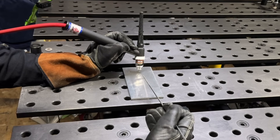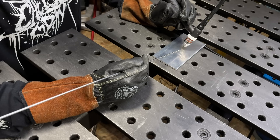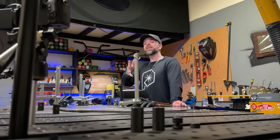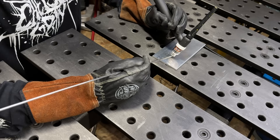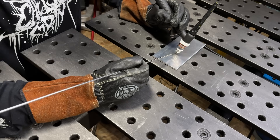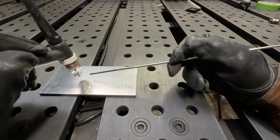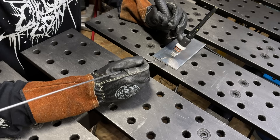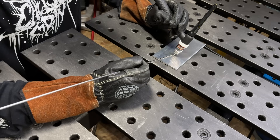At this point, start advancing your torch hand, which is going to start to travel, and this is going to force your feeding hand to start backing up. Make sure you do not move your feeding hand — remain completely stationary as you feed all the way back in while being chased with the torch. As you reach the end of the pass, reverse your travel direction back to the start, and this way you start to chase the torch by feeding the filler material out. Do this over and over. With your torch hand, people are much more consistent and comfortable, and this is going to train your filler material hand to start following along.